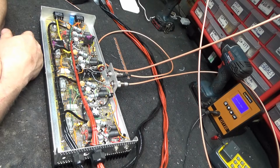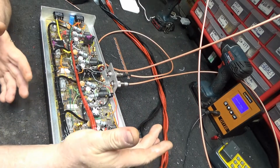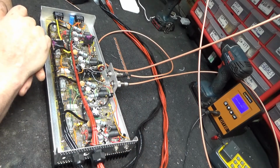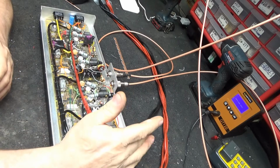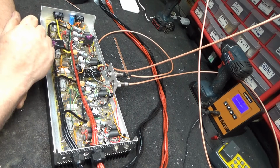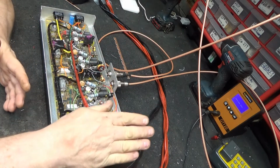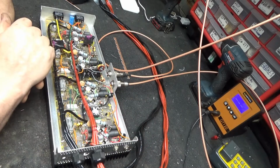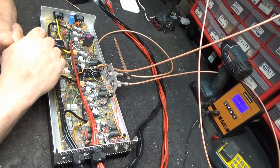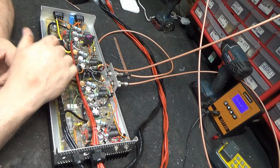It's up and working, doing pretty damn good, real good. With these inch transformers, this thing's gonna do really good with low drive. When you start lengthening the transformers out, it'll take more drive and do a little bit more output. But with this in here, you don't need but 100 watts to drive this and get pretty much full output on it.